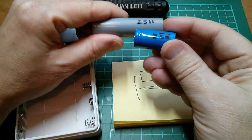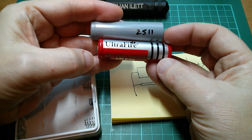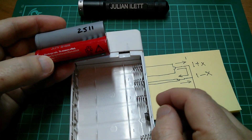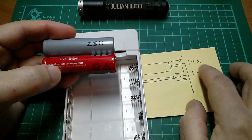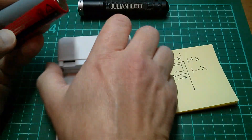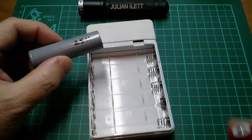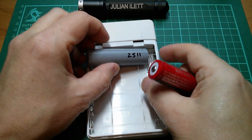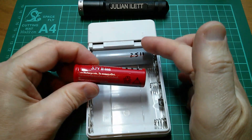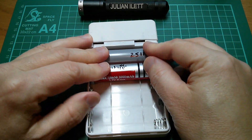I can't put this little cell into this power bank because it's just not big enough. So what I'm going to do is put this one that I've measured at 2.5 amp hours and one of these cheap eBay ones — which we know are fake — in parallel in this power bank. I'll connect up ammeters to measure the current flowing out if I put a load into one of these outputs, and then maybe measure the current going in if I put a charge lead into this power bank, to see that the currents from the two different cells are different. Let's put these two cells in, checking very carefully for polarity.